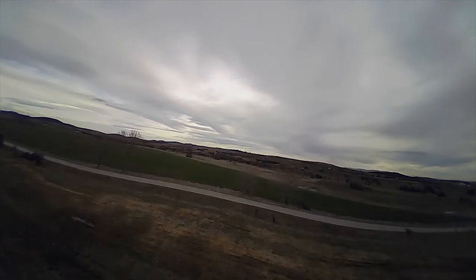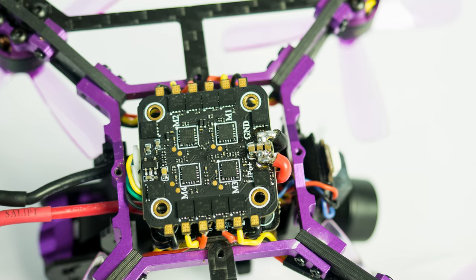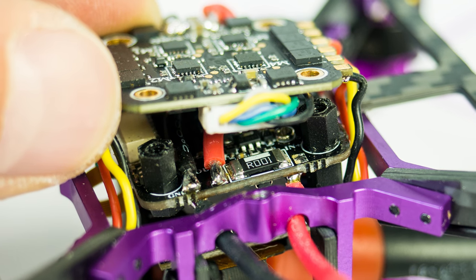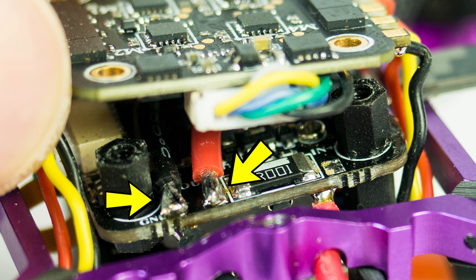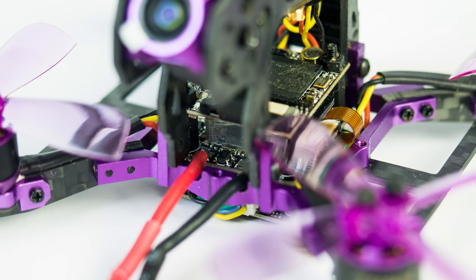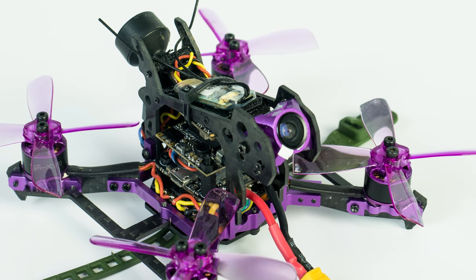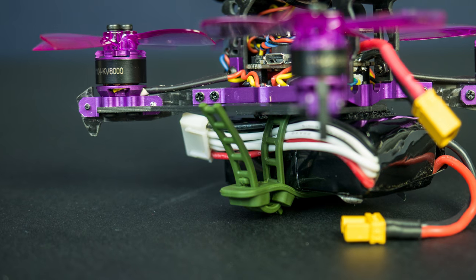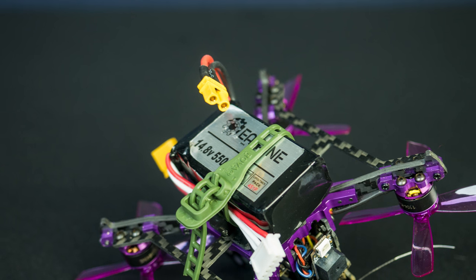I did want to make it work, but I am also exceptionally lazy, so since I didn't want to take the copter completely apart I only removed the bottom plate and somehow with a very steady hand I managed to do all the soldering and desoldering to fix the factory job and get the current sensor working properly showing the full amp draw of the copter. Power wire had to move to the front of the copter, which is not a big deal — just changed the way I mount the battery a bit. While the bottom plate was off I also took the chance to replace the velcro strap with something more reliable — straps meant for gardening use that have proven quite durable for holding batteries on copters.